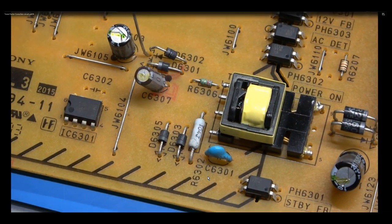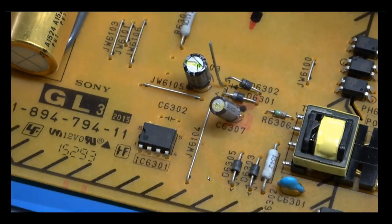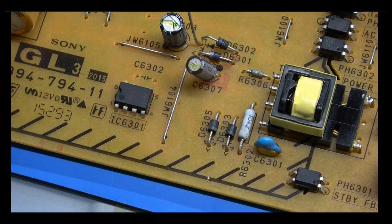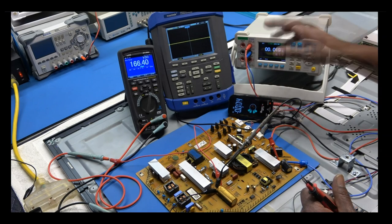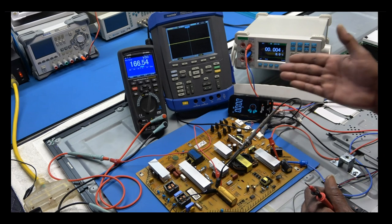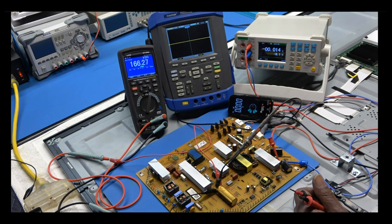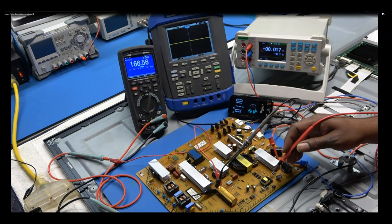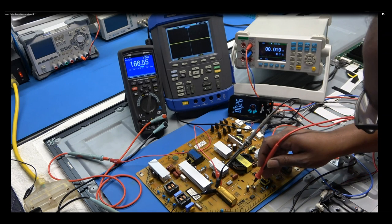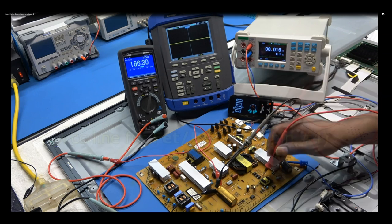So once I touch it, I have a little lead stuck in there. Once I touch that diode to that lead, you're gonna see what happens. Everything is going to change. I've got my little small meter, and the TV is plugged in. Obviously we just have the 166, PFC is off. I also want to show you that we do have VCC on this other diode that is still in the circuit. I'm gonna go to the cathode and see we have 16.5 volts, right there.